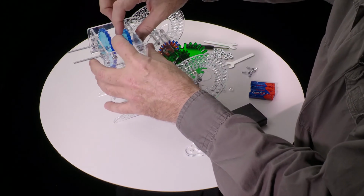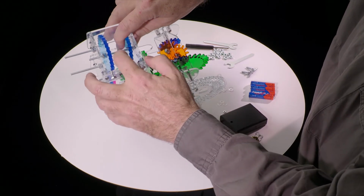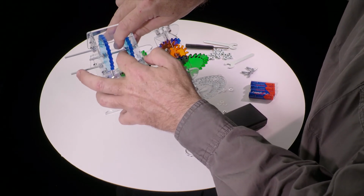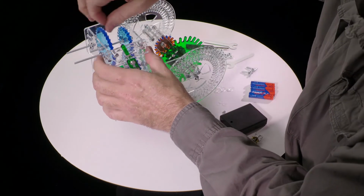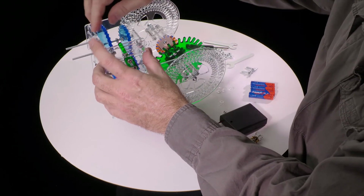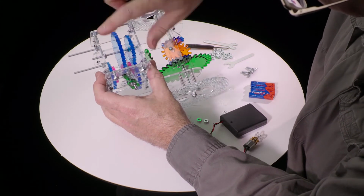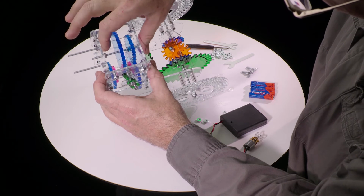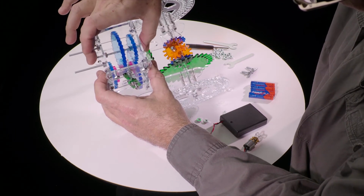Then slide this gear down and, holding the gear in place here, that will clamp both the nut and the shaft and let you turn this nut without turning anything else. Get that finger tight. And now back this one up to get it out of the way, and move this one forwards in that direction until it's tight, and there's again no wobble here.